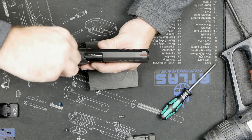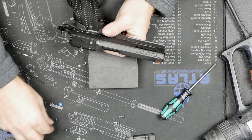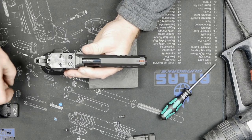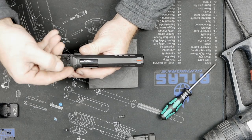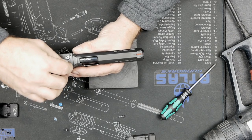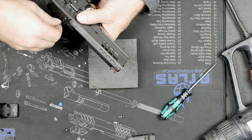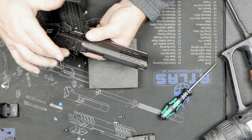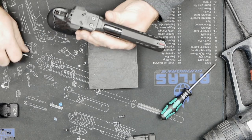Get a fresh Allen key. The key here is to not strip the hole on the way in, just as much as on the way out. I put a lot on this one, but a lot of it drips off — there's a nice coating there. The Loctite is going to need about 24 hours to set up, so try not to shoot the gun or put any heat to it for 24 hours if possible. I use the 90-degree side of the Allen key for my last torque and try to keep those fresh. I'm trying really hard to save the thread — I don't care if I wreck the Allen key, but I don't want to strip or open up the spacing on the screw.